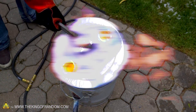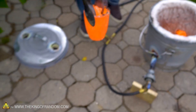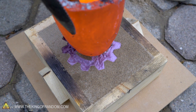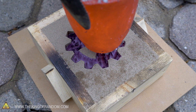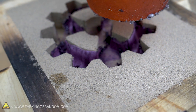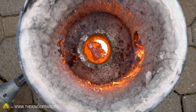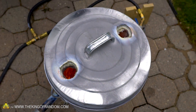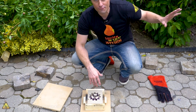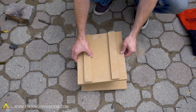Another fail. You can see that copper hasn't melted yet, but that's okay, because we're just going to use that radiant heat to burn out the styrofoam. Oh, that's beautiful — that looks really cool. Note to self, don't get too close. We'll put this thing back in — looking nice and molten there in the bottom. I'm tempted to try and pull the styrofoam out, but pretty sure I'm going to wreck the mold if I do. So I'm just going to leave that last layer on there, fire the copper up until it's ripping hot, and then pour it right in the center and let it flow out. We'll see if that works any better. Fingers crossed — in the meantime, we'll cover it up to keep it clean.